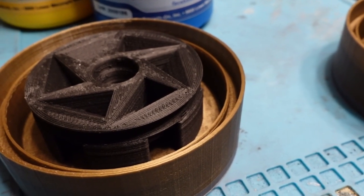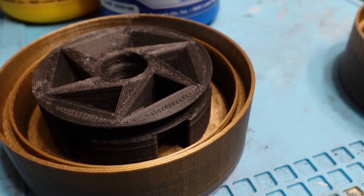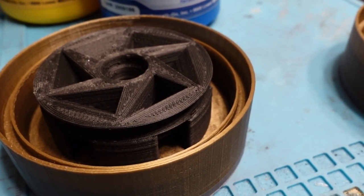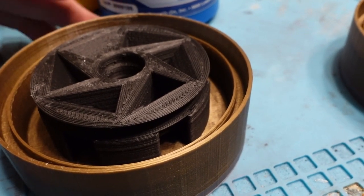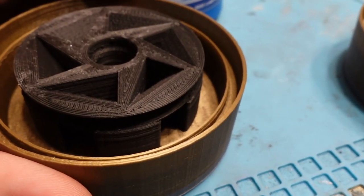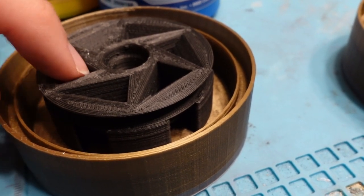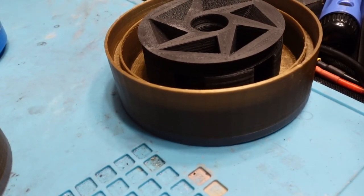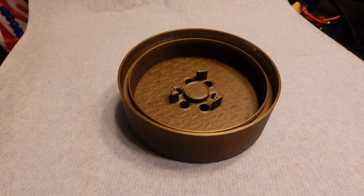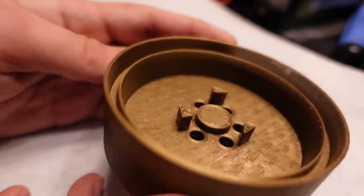The plane where the rubber belt groove ends is pretty much aligned with the groove in the mold, so the level of the tire doesn't envelop where the actual belt needs to go. I can probably just use a knife or razor blade to cut off any excess if it fills too high. I'm just going to keep pouring because I haven't figured out exactly how much weight of urethane I need for each of these. I'll look in CAD for a general estimate, mix up enough for two molds plus a little extra, then try and dye the rest for the second one. First, I'm going to spray this one with the actual universal mold release.